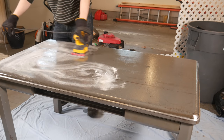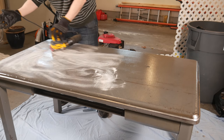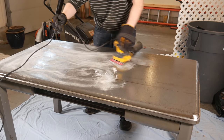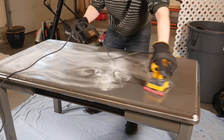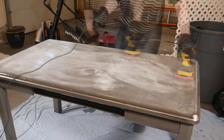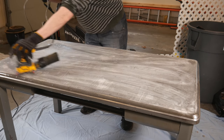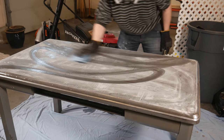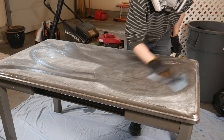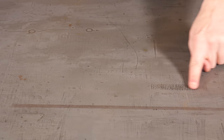Back to business. After 36 hours, that clear epoxy was rock hard and had done a really good job of filling in the damage. With my trusty power sander and breathing mask, I gave it a quick pass to smooth it out. The epoxy sanded pretty easily and 150-grit sandpaper gave it a useful finish — smooth enough, but I bet the paint will stick to it quite nicely. Once I had it wiped down, you can see how the epoxy healed up those imperfections. I think we're ready to get painting.